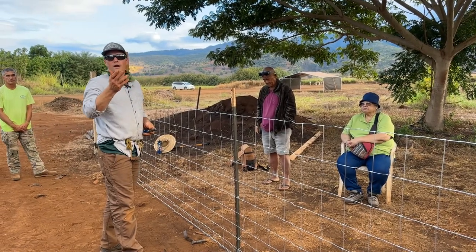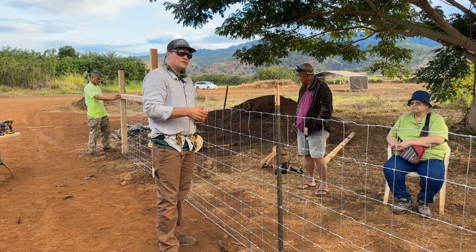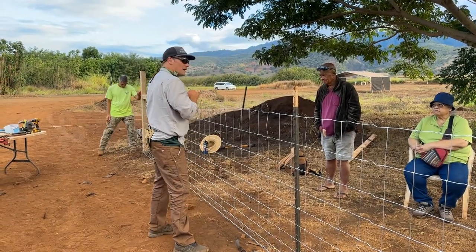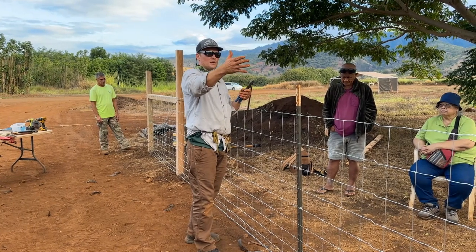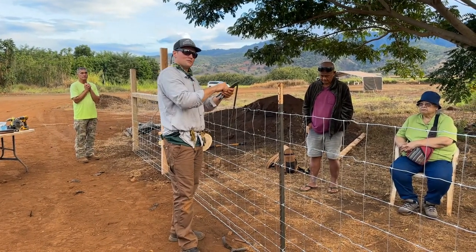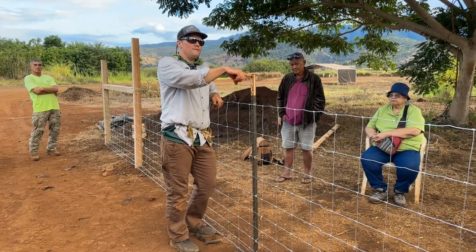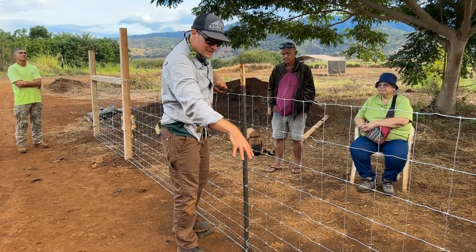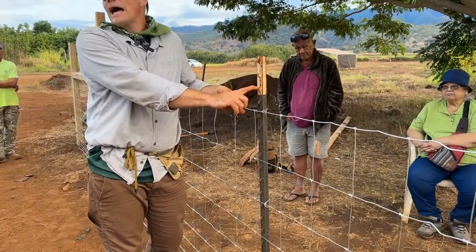Your next step would be your top strand of barbed wire. If you're only doing pigs and don't have any livestock in there for now, you don't need to do a top strand — you can always come back later. If you're going to do your top strand, you're going to do it just like you did the bottom strand. You can either do the two-hammer two-person way, or pull it with the come along. Oftentimes with pulling that top strand, it's nice to have something with some height to pull off of. Don't try to get like — if you're trying to keep livestock in, don't think oh, I'll just make my fence taller and put my barbed wire up here. The horse and the cow, they're going to stick their head right through it, scratch the back of their neck while eating over here, and push your fence down. So keep it about two and a half to three inches maximum.